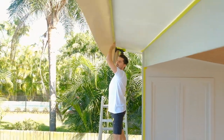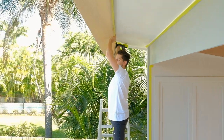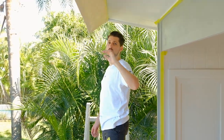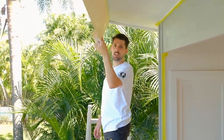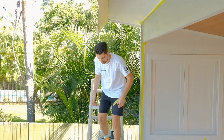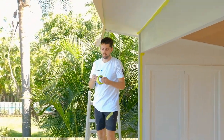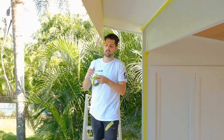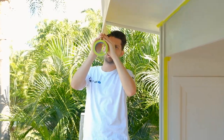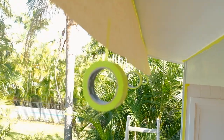I'm going to show you another trick so this doesn't happen. I'm going to grab some tape — because I've got a box of tape, I'll use a few fresh rolls — and I'm going to hang them off the paper here. This is a cool trick that Painting by Josh in Newcastle showed me, check out his YouTube. It keeps our paper nice and straight so it's not going to flick back up against our gutters. It's a pretty cool trick to keep our paper from flapping up in the wind when spraying. Tack up a bit of tape, secure it to the paper, and it acts as a cool weight. Thank you Josh for this cool tip.